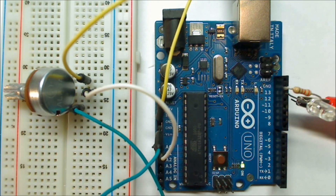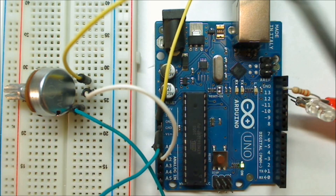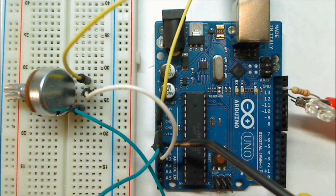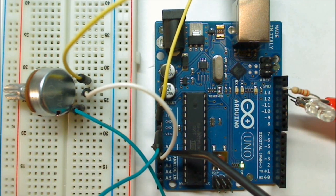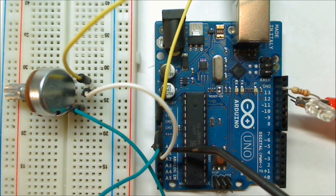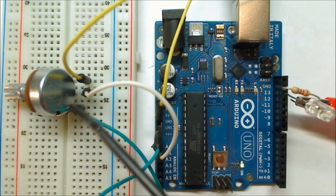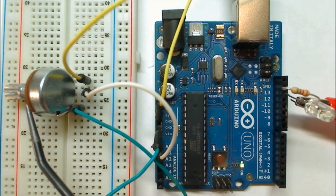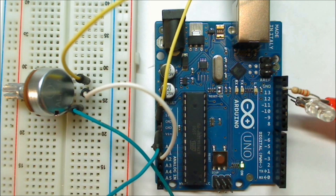Let's talk about this circuit briefly. Voltage coming from the 5-volt pin on the Arduino is applied to the potentiometer circuit, allowing current to flow through to ground. At the middle pin, we tap in and go to analog pin A0. We use the analog read function to measure the voltage the center pin sees, and that voltage changes based on how far the potentiometer has been turned.